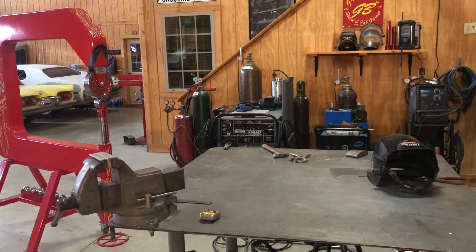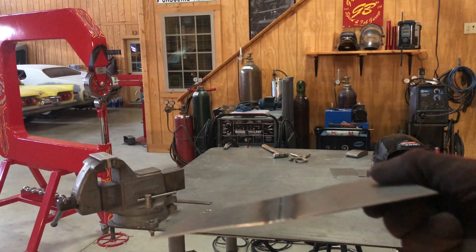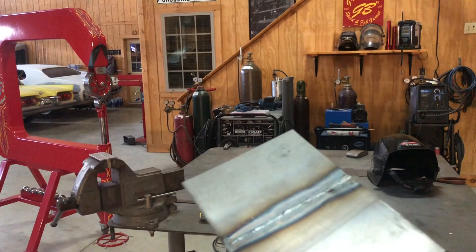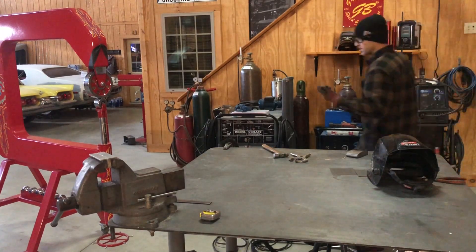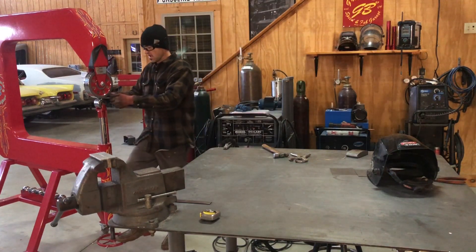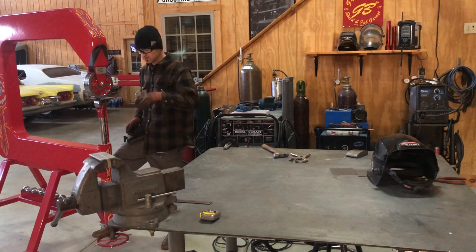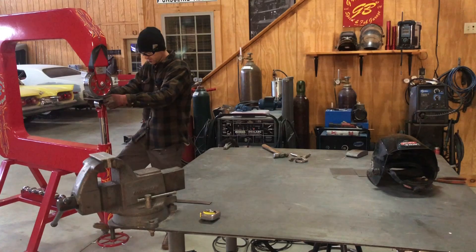You can't really tell much — it's straightened out the panel a little bit — but as you can see I've got some hammer marks in there. Now I'm going to go to the wheeling machine. My anvils are hardened, the bottom anvil is flat. I'm going to put it in there — you're going to hear it going over the weld, it sounds like going over rocks — and you just start increasing your pressure.